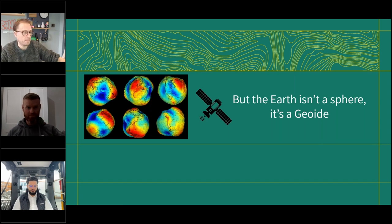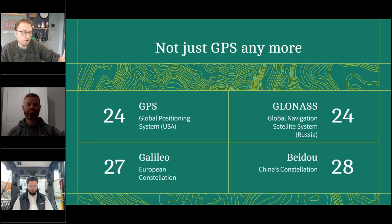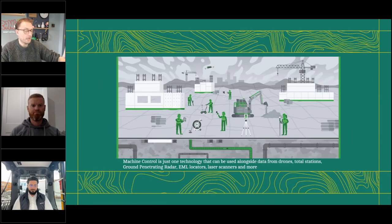It's not just GPS in the sky anymore. The four main satellite constellations we use are GPS (American), Galileo (European), Beidou (Chinese), and GLONASS (Russian). UniControl uses all four, which means you get a quicker, more accurate fix. Particularly for us in Europe, Galileo gives much better elevation data and a quicker fix — we've been selling surveying equipment for a long time and that is a real benefit.